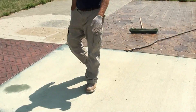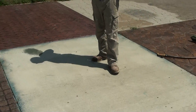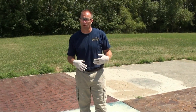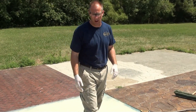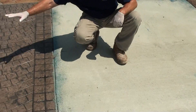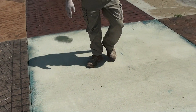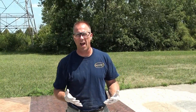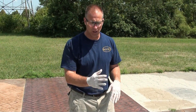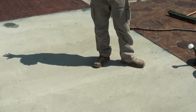You can see we have a small slab — it's in the middle of a lot of the slabs that we do during training. This slab was poured with a broom finish on it. It had some color in it and it doesn't look very nice, so what we're going to do is prep it for a coating. We're going to put our SM Pro over the top of this. You can see that when some of these slabs were sprayed with sealer, we have a mist of sealer around the outside ring — that's something we'll have to grind off. The muriatic acid will not touch anything with sealer on it; it will not hurt the sealed surface.